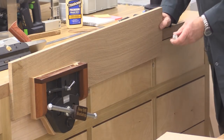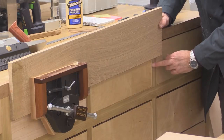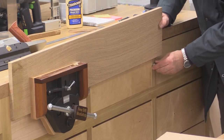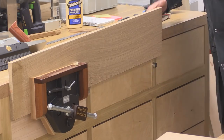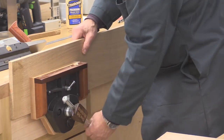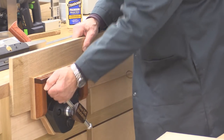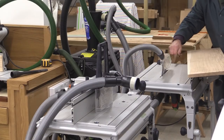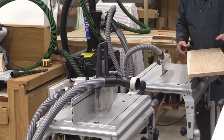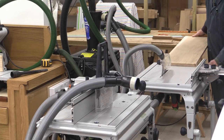Just a reminder for anyone who hasn't seen the video — I've actually put some 20mm holes and used the chamfer tool so that I can put one of these pups in there, nice and flush to the surface. That means I've got my wood supported not only in the vise but also just there. And you can see how I've got my two CMS units set up so that one is acting as an outfeed table for the other.